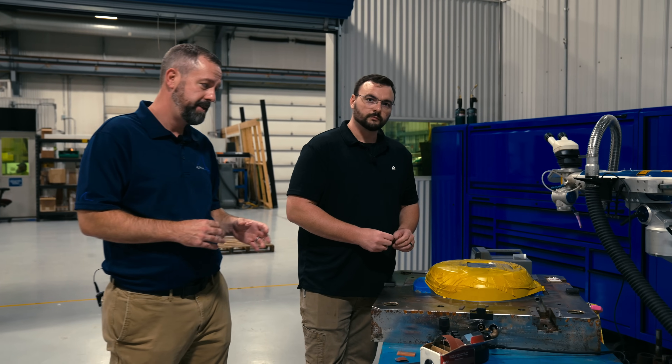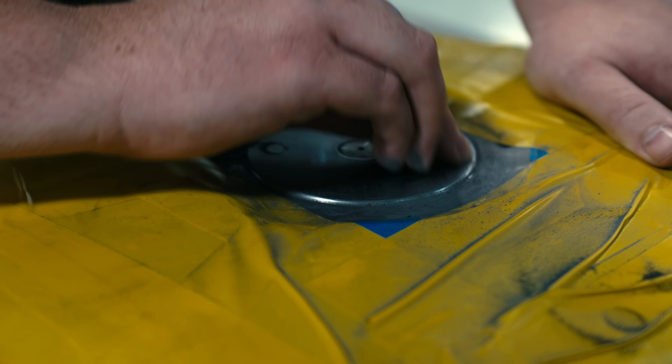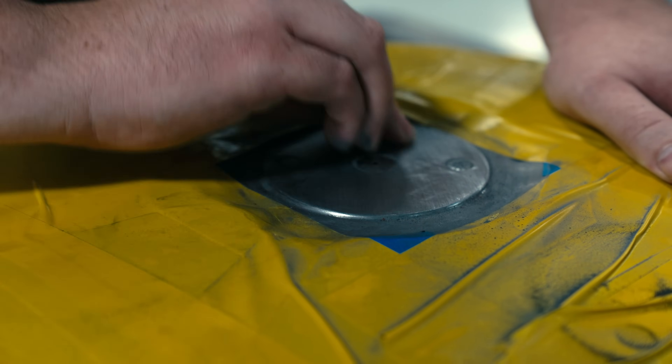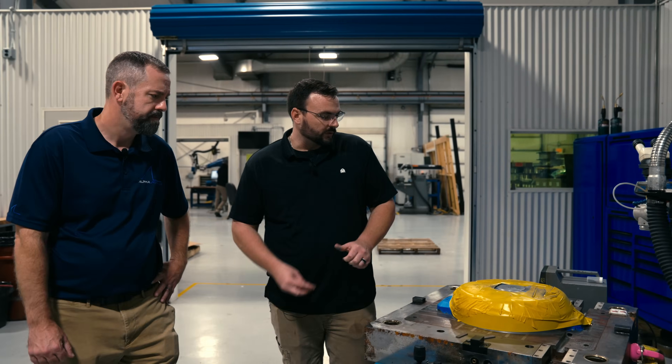We're here with Mike Learn, we have this engraving repair job finished. Mike, what are you doing next? So right now I'm applying a draw polish to blend the rest of the surface all together. That surface was all hand benched off by hand — it looks really good. If that was in the press, we could have welded it up, hand benched it right off, and if no engraving needed to be put back in, you could just bench it off, close the press up, and start running parts. Thanks for watching another episode of Alpha Welder — don't forget to subscribe, like, and share.